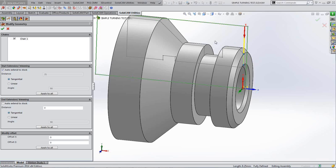So if you start to do some machining, and then you think, well, I'll change the order of them two cuts, and you swap them around, then obviously your stock situation is different for each one and would need recalculating. I know I bang on about that a bit, but it's something to bear in mind, that you are working with a constantly changing stock.